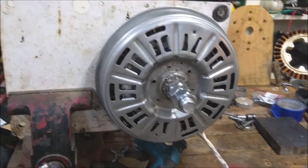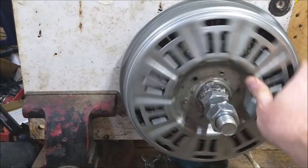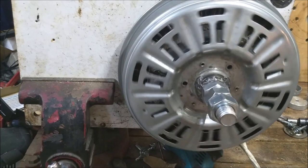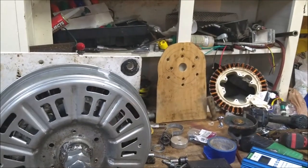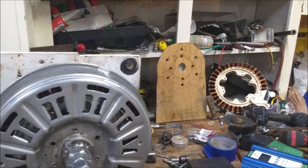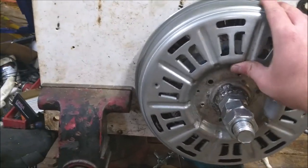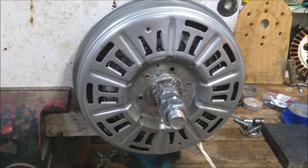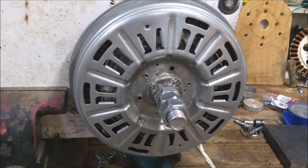Quick follow-up video on this thing. I tried to make it work on that wooden platform — I thought that would give me a good place to build a template. It's over there and it didn't work. The wood was just too flexible. As soon as I tightened everything up, the stator would warp and the magnets would pull the stator all around.